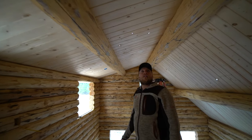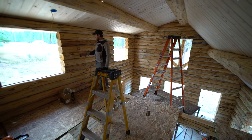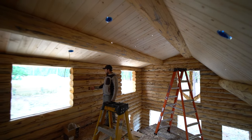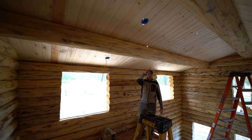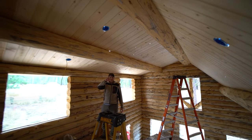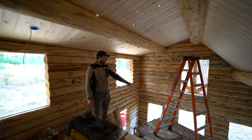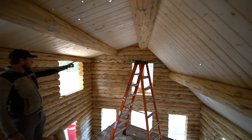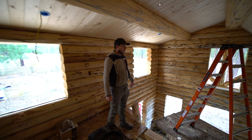And this basically goes to this. These lights are controlled by this switch here. We've run just the one wire from this outlet to our light, and then we'll hook these together. So this switch will turn these lights on up here. Pretty straightforward. And then downstairs we have our ceiling fan and then a couple of other lights, and then the outside lights.